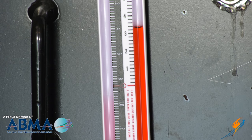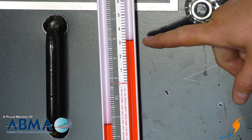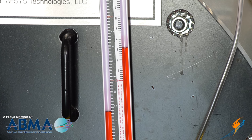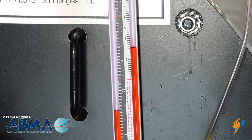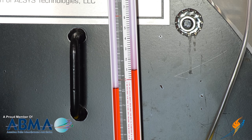Light off. So we've got a pilot pressure of three inches. Then our pilot cuts off once our main flame is established.